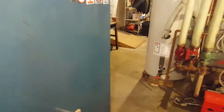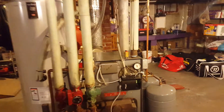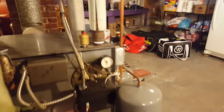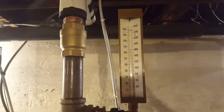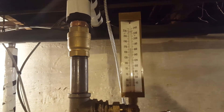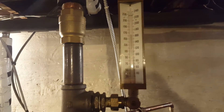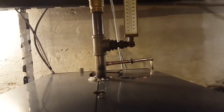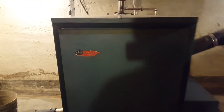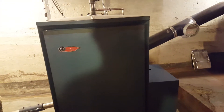I can cycle through the settings — it calculates a target temperature, which right now is 160 degrees. So it's going to pull the boiler temperature down to 150 degrees. Both boilers are currently reading about 160 degrees, which you'd expect since the circulator between the two is running. It'll pull down to 150, the stoker will start, go up to 160, and cycle between those two set points.